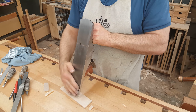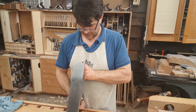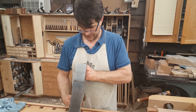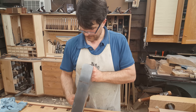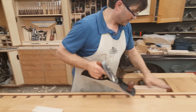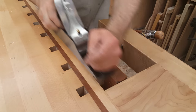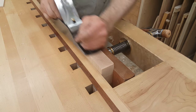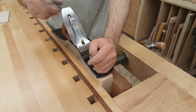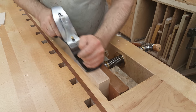Get the blade parallel to the sole. I find it easier if you're looking at a light colored background when you do this. Once it's close, I'm going to retract the blade fully. I want to start planing with the blade all the way in. So I've got my chamfer. Now I'm going to start planing. And while I'm planing, I'm going to advance the blade slightly — I do that by spinning the adjuster knob in a clockwise rotation with my index finger, all the while I'm planing.